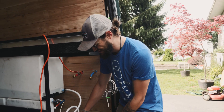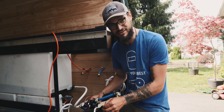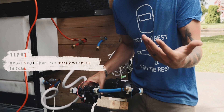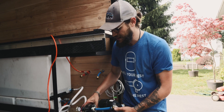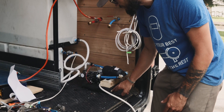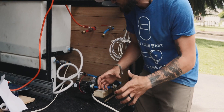The second hack is one of my favorites: where you end up mounting your pump. You can put it on a board and wrap that in basically any kind of neoprene or soft rubbery product — this is actually meant to go in the bottom of drawers where dishes or silverware go. Wrapping that around the board is another layer of sound isolation when you mount it in place. You get the isolation between the neoprene and the board, and the pump itself has a built-in isolation shock mount.